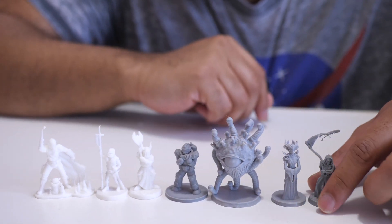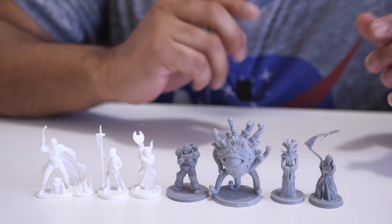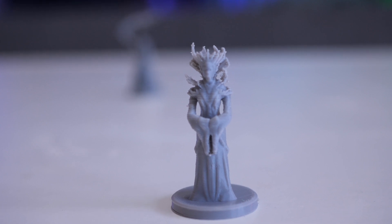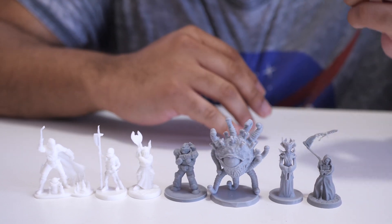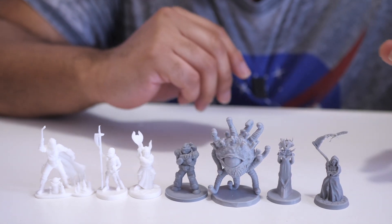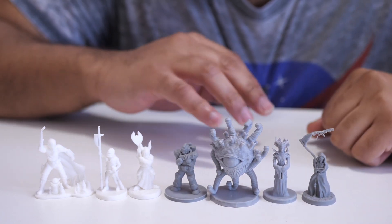These last two models are a good example of what happens when you have thin models that have fine detail in them that you're trying to capture with filament. Unfortunately, it tends to not come out all that great. If we're looking at the face of this model right here, it's really hard to make out the details on the face — you know that there's a face there, but it just looks a little bit meh. You can probably improve that by slowing down the speeds, but running at the default speeds, things just get a little bit more murky. As for some of the adornments on them, the shapes came out okay, but it looks a little bit rough around the edges, as it's trying to print at those high speeds these really, really small details with that 0.4 millimeter nozzle. So this one did not come out as good as the others.